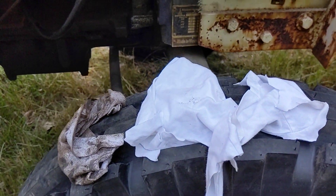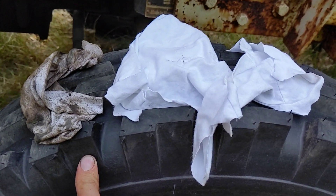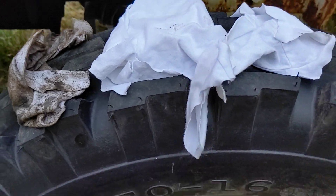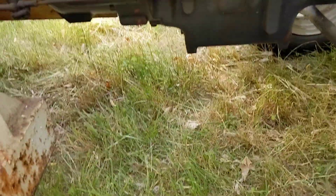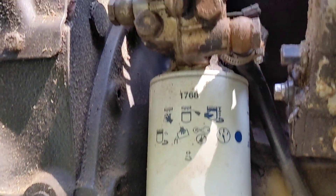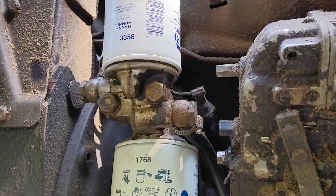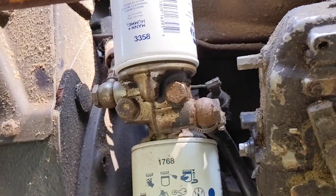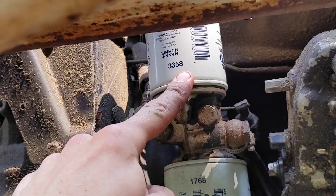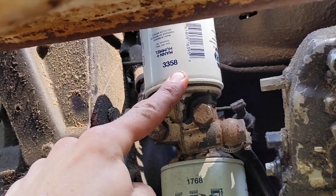You're also going to want some clean rags for cleaning everything up. I already went and cleaned the spots we're going to be opening up — you can see it's pretty filthy. When working on a fuel system, definitely don't want to be getting junk in there. Now the fuel petcock's shut off. The filter is right up there above the oil filter. It's a little challenging on this tractor because we've got this giant loader on here which blocks a lot of the access. So with fuel off, we're going to unthread that filter, make sure everything's nice and clean, and thread the new filter on.